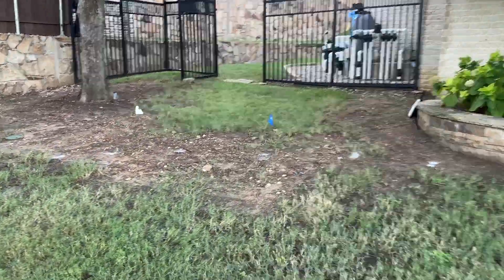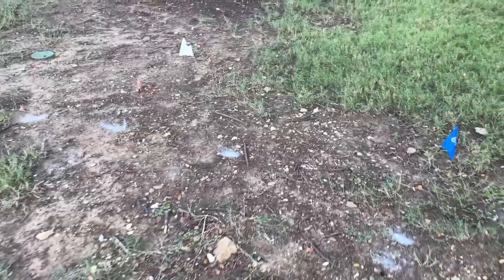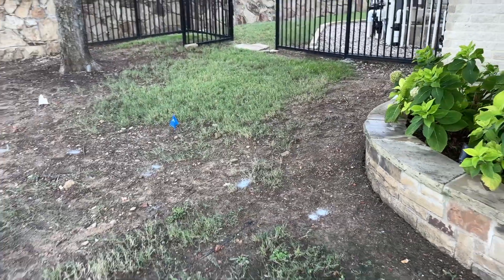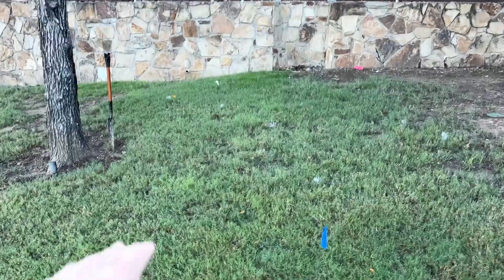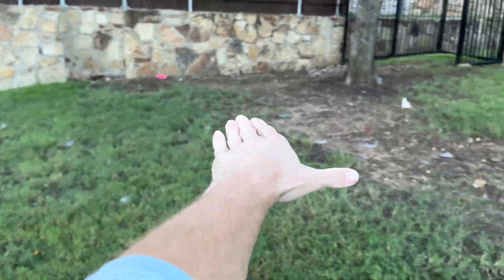As you can see, there are a lot of areas that have eroded. It's really hard for grass to grow when it's constantly being washed by rainfall. Erosion depletes soil nutrients, and between the shade from these trees, it's really hard to get grass to grow here. One of the things we need to do is manage the grade. We're going to come through — you can see it marked with white paint — and retain the soil strategically. We'll cut this back, level it out, build a small wall, and regrade.